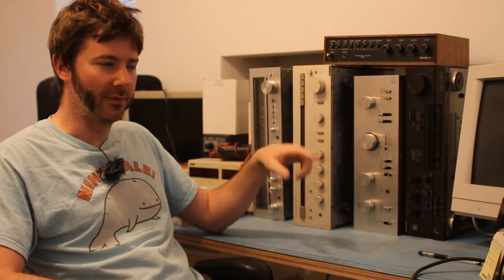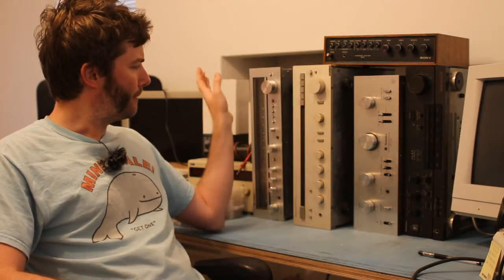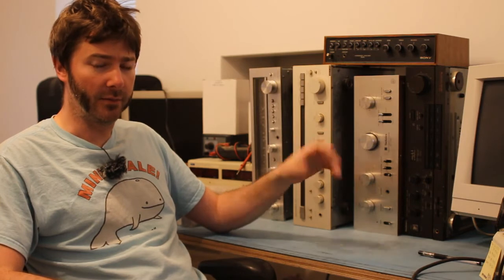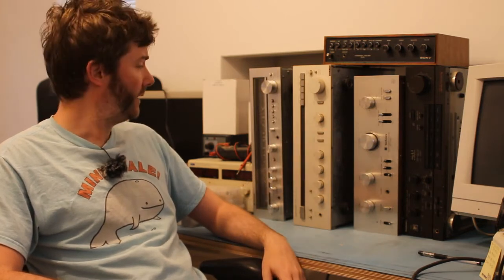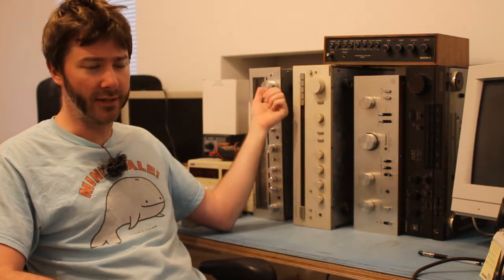And if I remember rightly there's also some damage to the phono preamp where it got some current passed through it with a bit of dodgy grounding — I think it blew some tracks off. Then there's the Trio KR2010L which just stopped working one day, and I found that the thermal trip in the power transformer had gone.